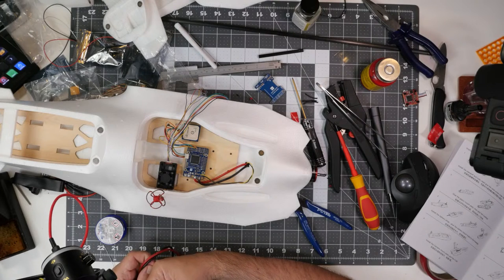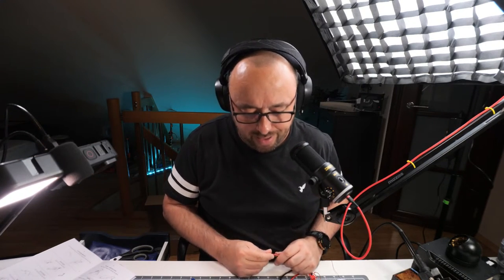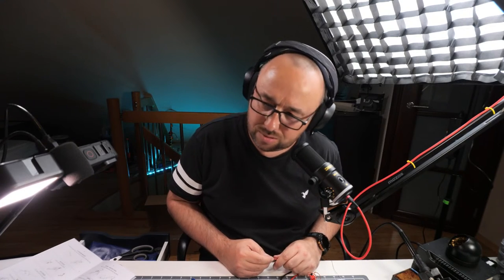Blix Band Beats wrote that double coated Runcam hybrid more because I heard they were known for components popping off the boards. I don't really think that conformal coating will solve that. I don't think that the conformal coating will protect anything from popping from the board, because the bond that the conformal coating can apply is much less than really the bond that the solder has. So this was just a crappy soldering.